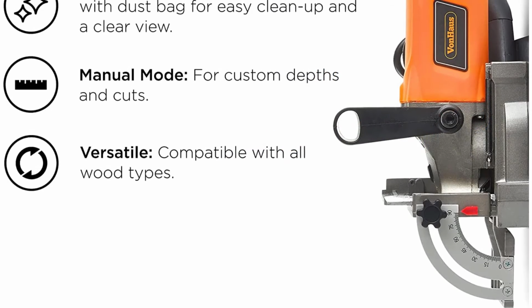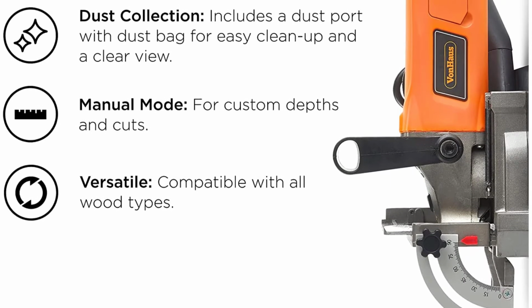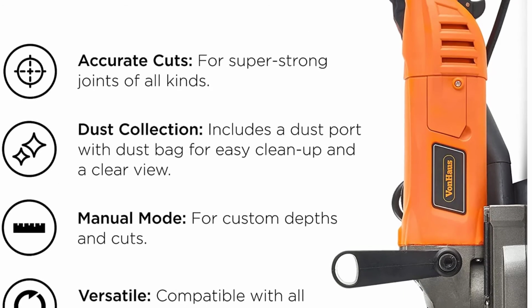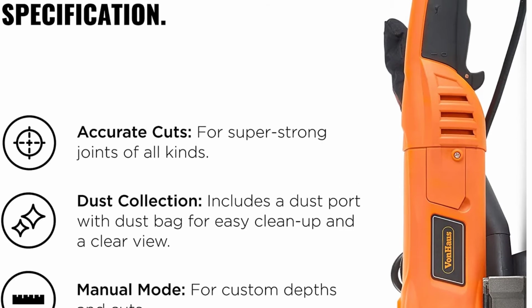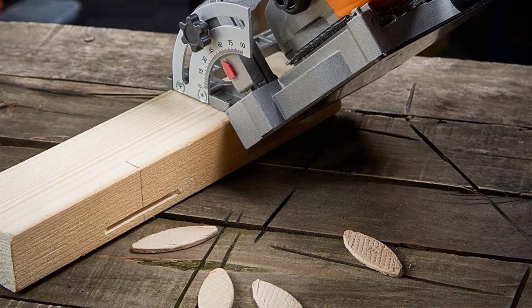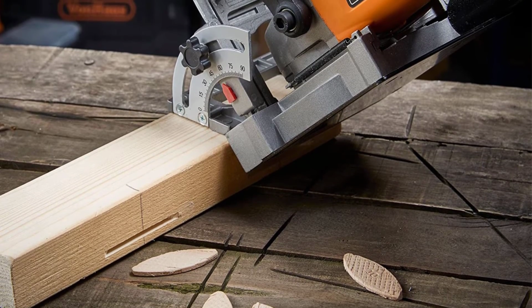is capable of spinning the 4-inch diameter blade to 10,000 revolutions per minute in order to cut through most hardwoods without catching or kicking. However, users note that the blade dulls relatively quickly and can take several minutes to replace in between cuts. In addition, the joiner is not capable of accepting a 2-inch diameter blade for making small cuts, as required by many professional woodworkers.